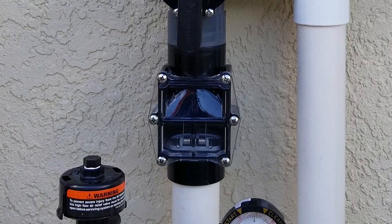The first valve is the feed line check valve. This allows water to flow only one direction. In this case, water leaves your filter and goes up the wall toward the solar panels. This check valve is installed so that solar panels do not drain backward through your filter when your pump turns off, which could force filtered debris back into your pool.